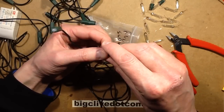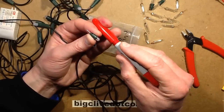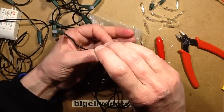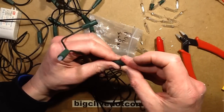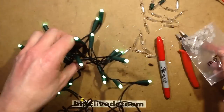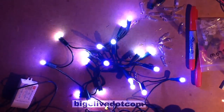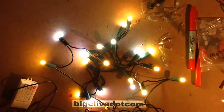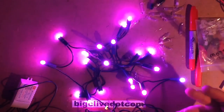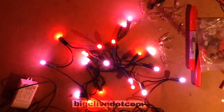Here's the last LED going in. I'll just mark that with the positive side as a precaution — if I put these LEDs in the wrong way round they will almost certainly fail instantly. So that goes in there, and then they should all light. Yes they do. Let's see if I can not cause a huge avalanche under my bench here. Here's the string of lights. Let me turn this off — they are all holding the colour, doing quite well. Two things I'm looking for: is the current going to be high enough to allow colours like yellow and magenta to actually look properly? But the magenta is working, that's good. Because if the current's too low the red takes priority, pulls the voltage down, and means there's a bias towards red. But this looks pretty good — that looks very nice.